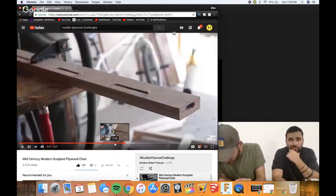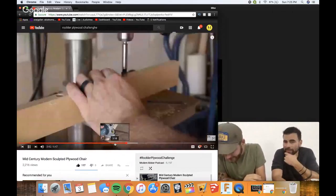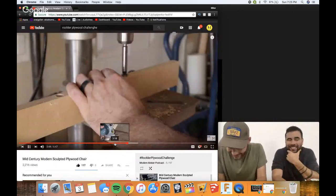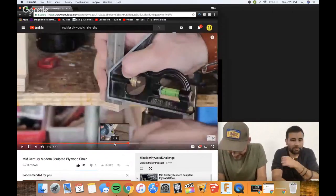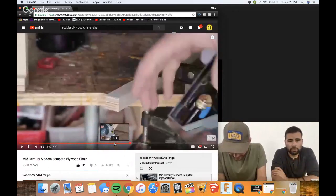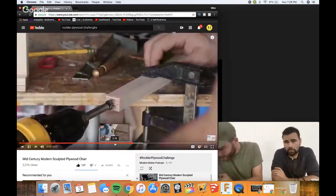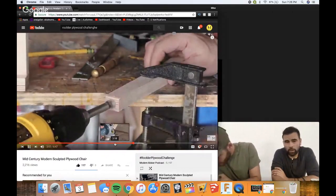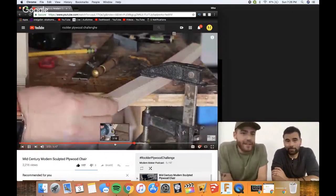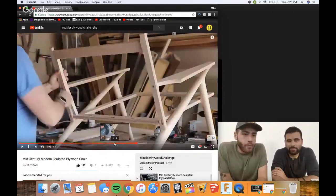I later come back and use a weave to build the base of the chair. The one thing I didn't account for was the joinery on the back of the chair. So what I ended up doing is using dowels. I centered a mark on my back stretcher, and I used that mark to center the dowel that I inserted into the back stretcher, using one of those small Forstner bits. Making a little mortise and tenon.